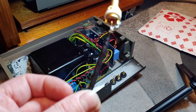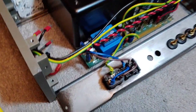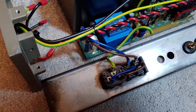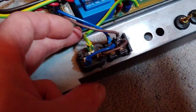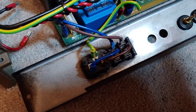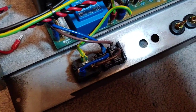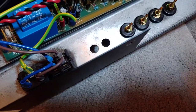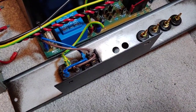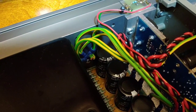I've been getting a slight hum going on as well. What I noticed at the back is that from the IEC plug, the earth wire from the IEC was connected to the ground — the earth — on the RCA plug, which I wasn't happy with. So I'm going to earth it individually off onto the casing.